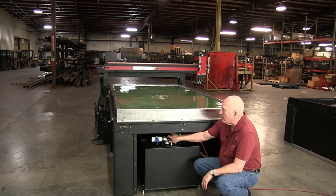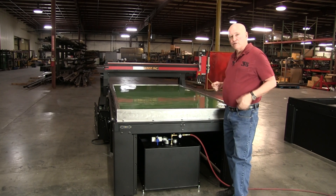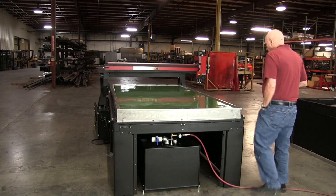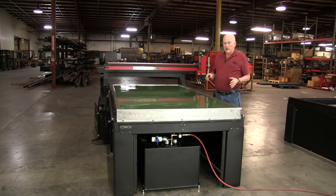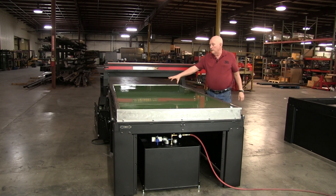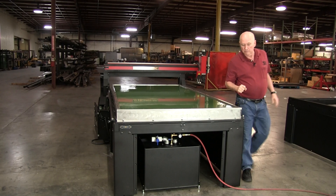I'm going to stop it right here — that's about the level that you're going to cut at. You're going to be about a half inch below your plate; the water will splash up on your plate and keep everything nice and cool if you're doing steel. Now, the sump openings are in the middle of the tank. The reason for that is if you run out of water in your transfer tank, you're now pumping air. We put it in the middle so it doesn't splash out, and you're going to have slats and a plate on top to minimize that.